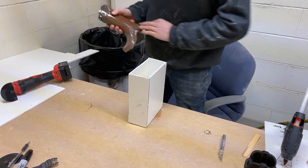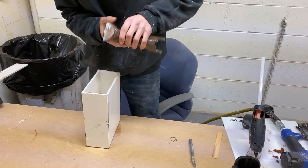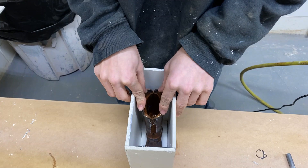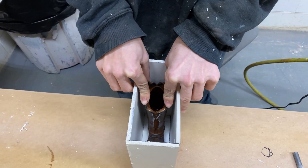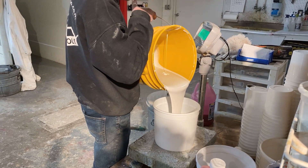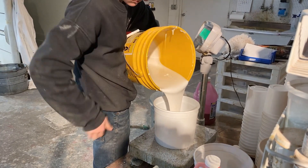He's putting hot glue on the bottom of the boot and he's going to be really careful when he lowers it down so he can make sure it's not going to touch a side wall. Everything you see him using here will have links in the description below — if you don't know where to get some of this stuff just go down there and you can find it all. He's now got it mounted into the mold box and is getting the silicone ready to pour.